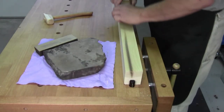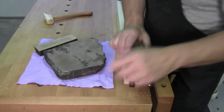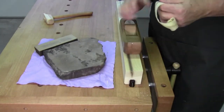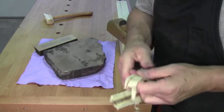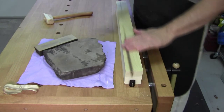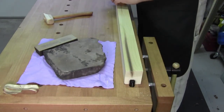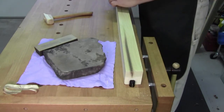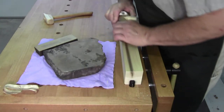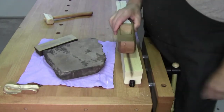I do sort of buy the concept that by skewing the angle you're getting more of a serrated cut, whereas coming straight on they're a little more blunt. I hope that helps clarify the reason why I did the video. I know it was a bit of fun, but I was being realistic. You need to plane, you need to get wood off — that's a pretty thick shaving. It doesn't matter how you sharpen. It really doesn't matter. Just sharpen.